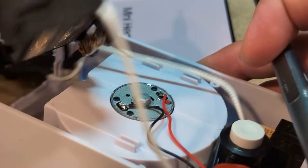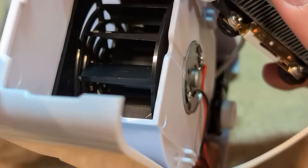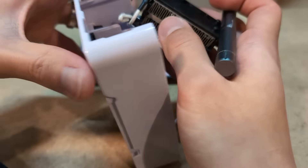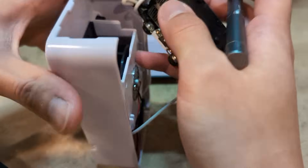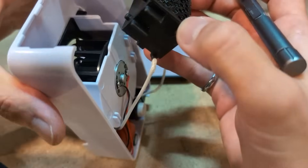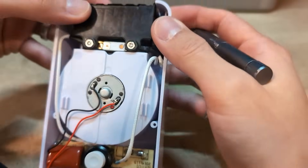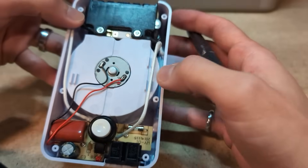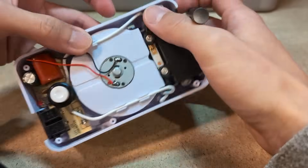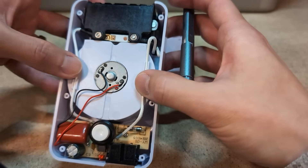Pretty straightforward — really nice compact design. You can see the impeller here. It brings in air through the top and then shoots it out vertically, so it looks like a centrifugal fan, but they made their own, which is kind of cool. Now that we've checked that there is some kind of thermal protection, let's try hooking it up into our X1C. We'll have it running on a closed thermal loop with that Inkbird temperature controller — it's not going to be super accurate, but it's going to be good enough.